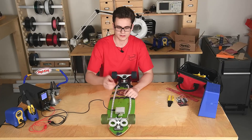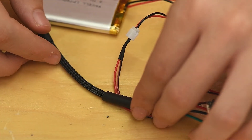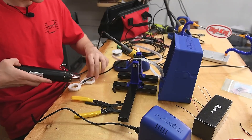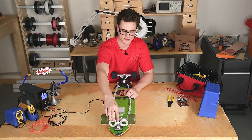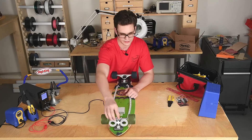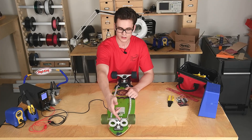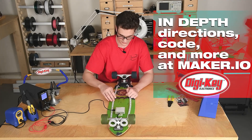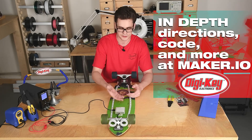The first step I would recommend is soldering the connections for the LED rings. First, sleeve your cables and heat shrink them at the end — this ensures the cables are protected and look a lot cleaner. Next, connect the ring enclosure to its mount to get something concrete done early. Then solder from the ring to the first strip, and from there solder to the next strip, or if it's your last strip, solder straight to the board.